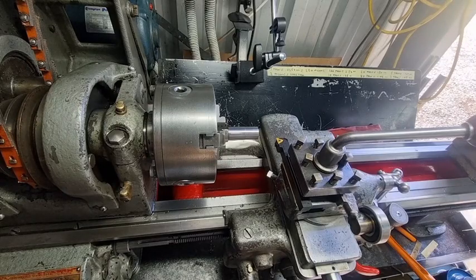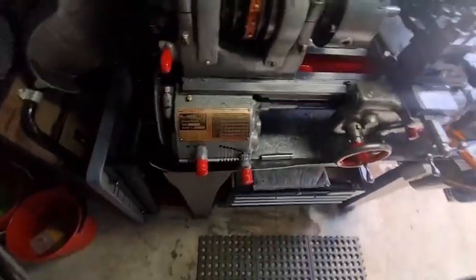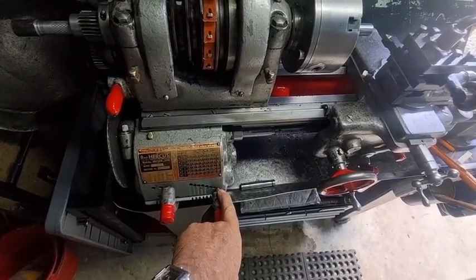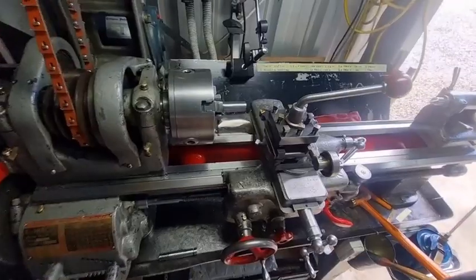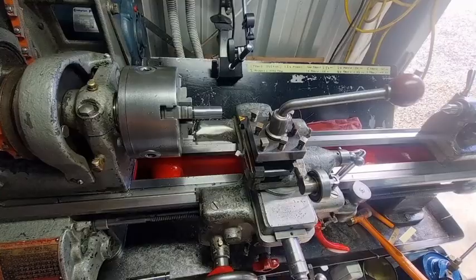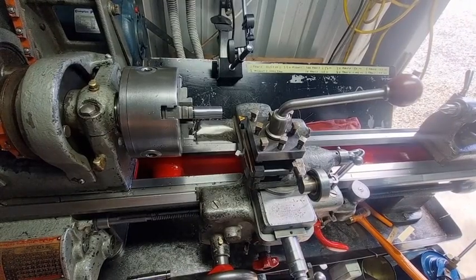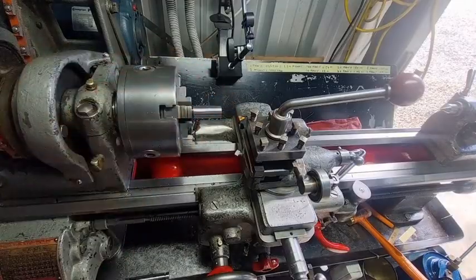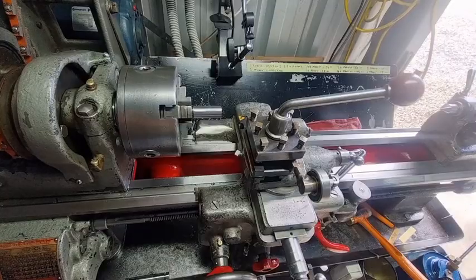That's my advice for surface finish on mild steel. I have tried using higher RPM - while it may work on some metals, I don't find that speeds and feeds help a lot with mild steel. I'm running the slowest feed rate on the Hercus - that's setting E up the top, run down on the lowest setting on the tumbler gear. I've played around with speed and run 1400 RPM - it makes no difference, mild steel is absolutely crap no matter what speed you run it at. My advice: lower the tool about half a millimeter, you'll get a smoother finish, and make sure you put plenty of oil on. Thanks for watching, bye for now.